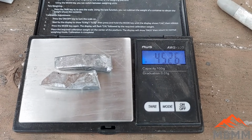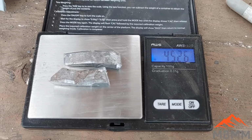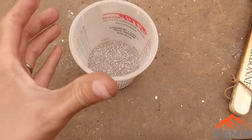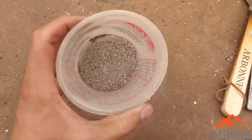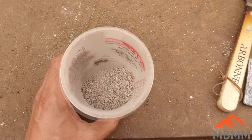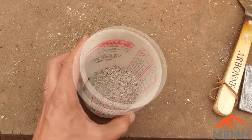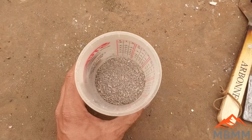But I think at these high temperatures, we'll be able to cupel the lead and copper away with that higher ratio, that 4-to-1. All right, one guy left me a comment and said that I wanted to be careful because platinum and palladium will actually dissolve in really caustic, hot stuff like lye if you get it way hot, like 2,000 degrees Fahrenheit. So he suggested I try a smelt with just borax and silica sand.